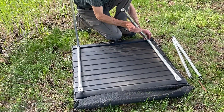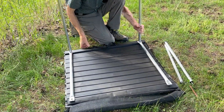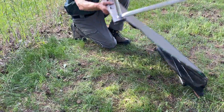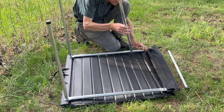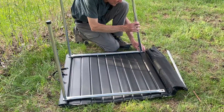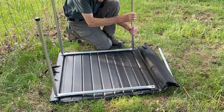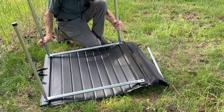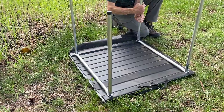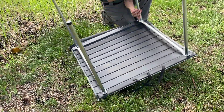It makes a very strong connection. Notice as I'm screwing these legs together that there are no diagonals. The diagonals are purposely eliminated in this design so you can put your legs and your knees underneath the table and you don't bump into hard bars and stuff like that. So it's very functional. With four legs screwed in, you can tighten with both hands because the steel nut that's in there, you won't strip it.